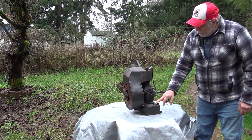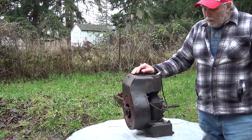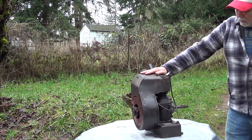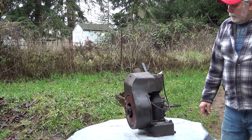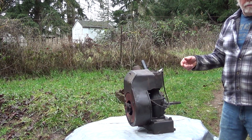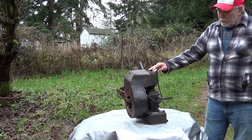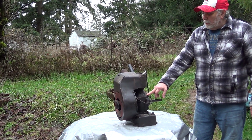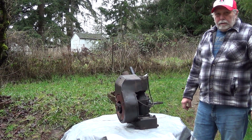It's all self-contained — gas here and oil in the sump. On the McCormick I just showed you, the crankcase is enclosed to keep out debris, whereas the early engine was open to all the elements. This is a one-horsepower engine, governed at a steady running speed. They also made them with a throttle governor where, as the load changes, it opens the plate in the carburetor to let more air-fuel in to maintain speed. These were really superb engines — the main bearings were Timken roller bearings, the connecting rod has insert bearings and an oil pump, and it has Stellite-faced valves. They were made to last a really long time, not like the cheap stuff we have today.